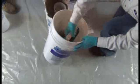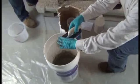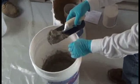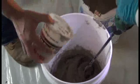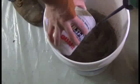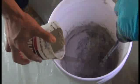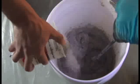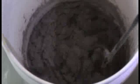The consistency we have here could be used in other situations, but we are looking for a heavier build that will stay vertical. So we begin mixing again, adding small amounts of Con-Korite to the blend until we have a heavier, trowelable consistency that will stand up on its own even inside the pail. Mix until uniform with the dry mortar no longer visible.